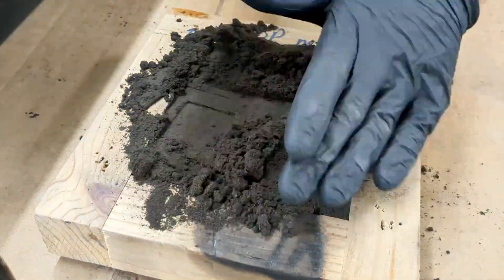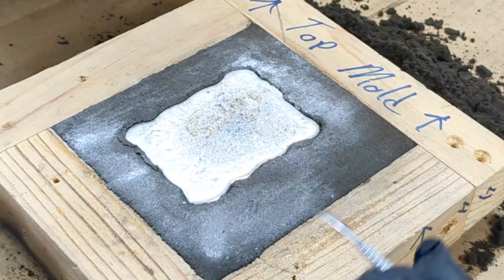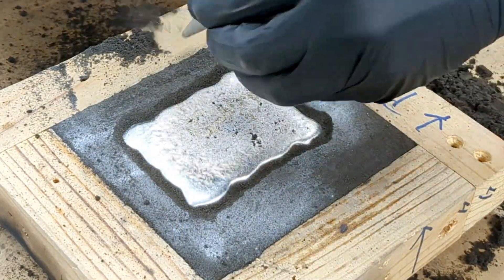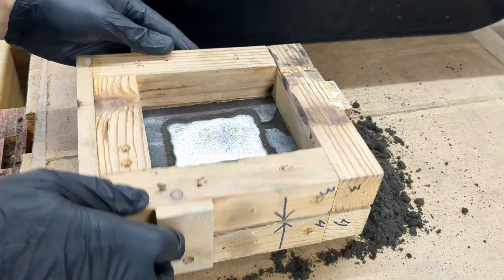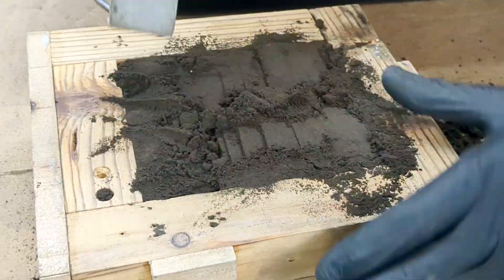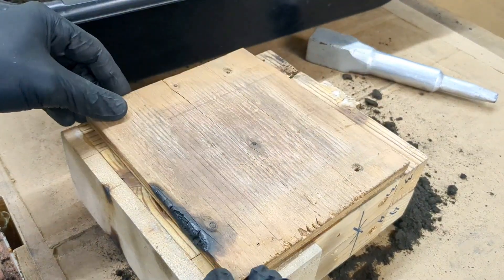This is going to be a two-part mold. When casting aluminum, it never comes out good for an open pour like I did in the beginning with the pewter. Pewter is a heavy metal so you can do that with open pour molds, but since I'm doing aluminum I need to use a two-part mold. You put the pattern in, put the talcum powder over top of it, then compact sand down onto the pattern. I'm cutting out a location for the sprue and the vent — once I finish one half, I can carve out the sprue and vent on both halves.